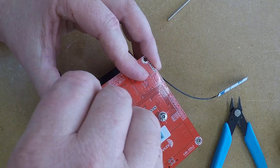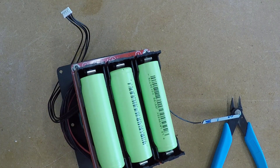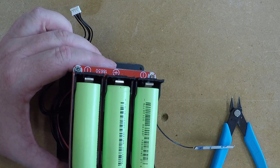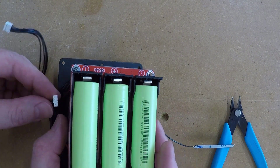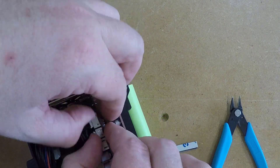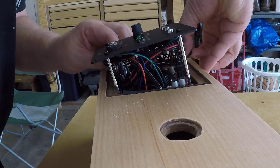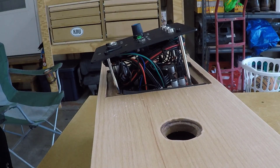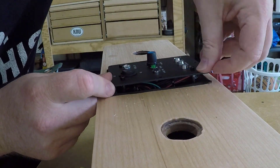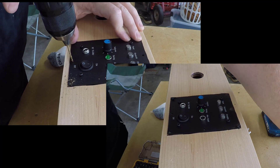Now take one of the other riser sets — you're going to thread those into the long risers through the amplifier board. Make sure you don't mix the sizes. Next, you're going to insert the batteries into the battery holder, and use silver allen screws to attach this board to the risers coming off of the amplifier. Don't forget to plug the battery board into the amp board. Now carefully insert the assembly into your speaker project — take care not to pinch any wires. The kit came with four gasket strips you can install to get an airtight seal. Now you just pre-drill your screw holes and screw down the mounting plate.